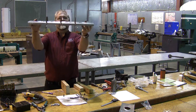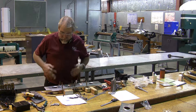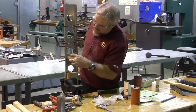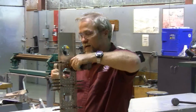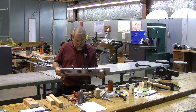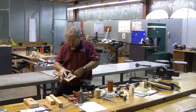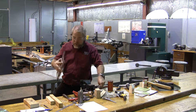All the holes are nicely drilled. Right now there are little pieces of aluminum shavings and burrs on every sheet, so unfortunately the most heinous part of this entire project is we have to take it apart, deburr it, and then reassemble. One thing to be aware of: there are four layers of aluminum on the outside rows and only three layers on the inside rows. We've talked about how to select the rivet lengths before — I'll let you do the selecting, but make sure you select properly. Here's our spar riveted together — this is a Cessna maintenance manual spar splice. You do not rivet along the last edge for this project, but if we were doing this on a real aircraft, we would now take this and very carefully rivet it into the aircraft.